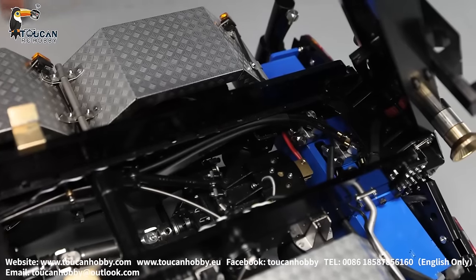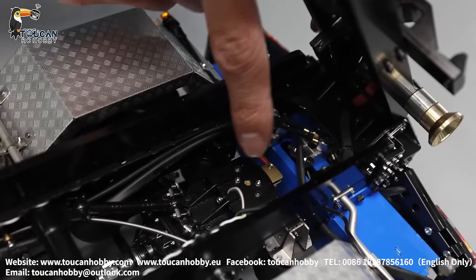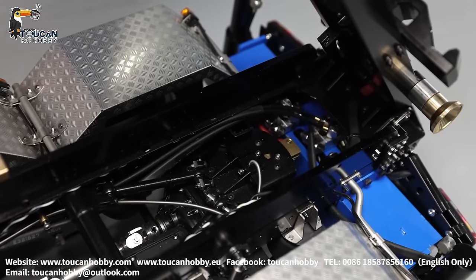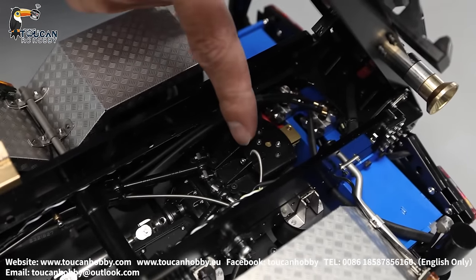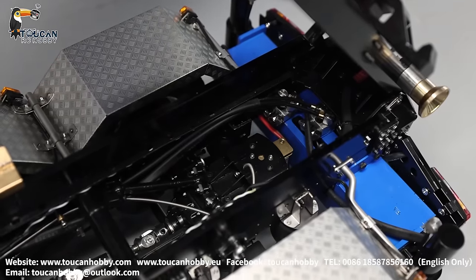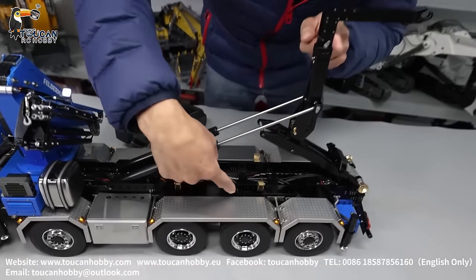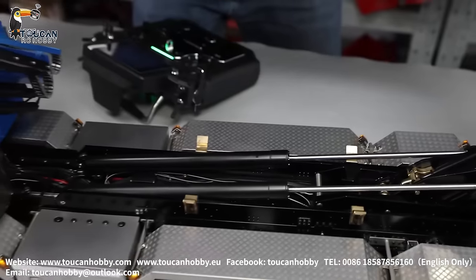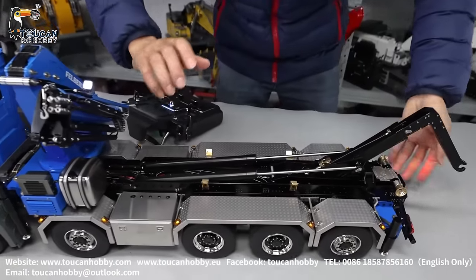Stop pump. So here under the cover, that's the screw driving cylinder and pushing oil for lifting up the axle. Lift up. Now it's in position. That's the wires. When you lift up, it will pull and also cut the power for this rear side axle. Drop it in position. So after we lift up here, you will see the chassis, the rail, the thickness, double girder, yeah, downside and top. So it's very strong. When you lift up, it's very strong. You don't see the deformation of the chassis. It's not twisting, it's very strong.